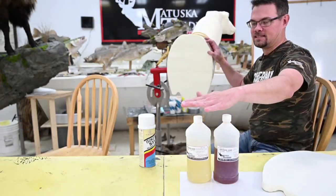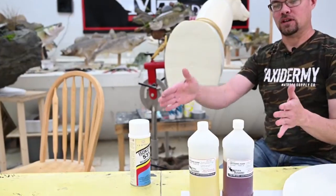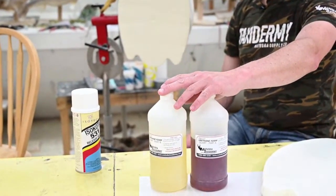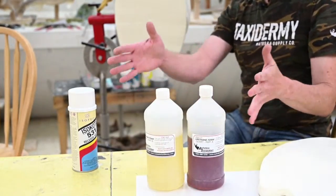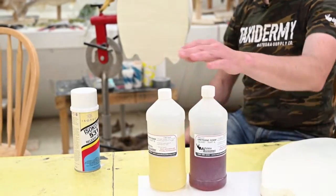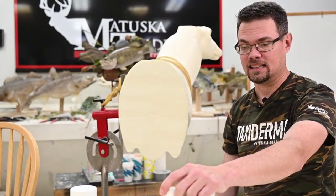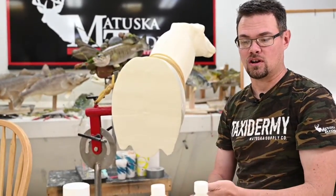So what that means is that poured into a 1 cubic foot block, this foam will rise to a consistency. That block will weigh approximately 3 pounds. That's how they gauge density. So if this was a 10-pound density, it would be a very heavy block, 1 foot by 1 foot block, and it'd be very dense, and it would take a lot of material. We also sell a 10-pound foam, and we've had phone calls where people say, hey, we got this foam and it's just not rising like the other, and that's because that's the 10-pound foam. It's very, very dense and very strong.